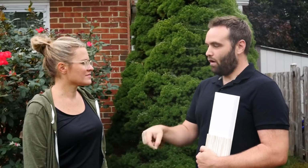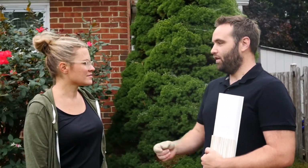What's your preference in finding studs? It depends. A lot of times I can knock and find them. Other times I can look and see if I can find a nail or a screw on the wall. If I'm doing a project from the beginning, I'll go through and mark where the studs are down below, so when I come through later, they're already marked out and I can just go through and shoot.